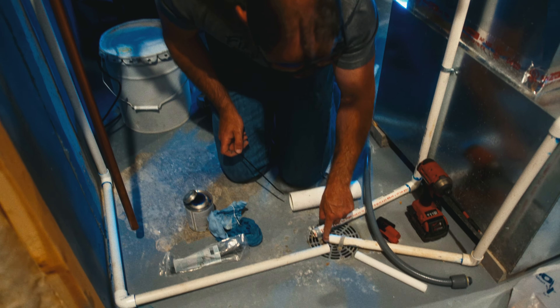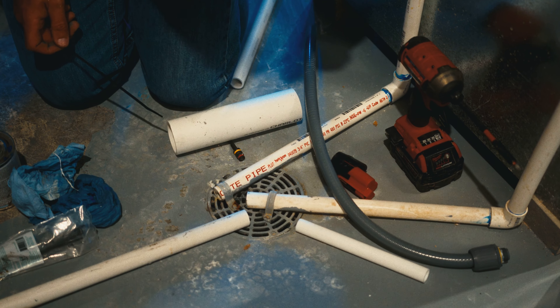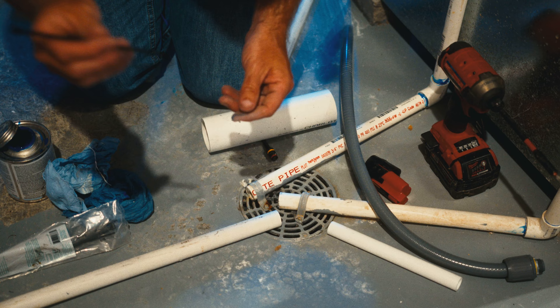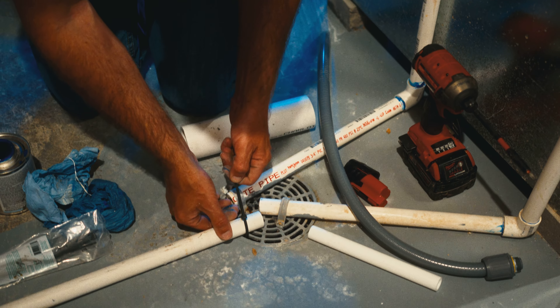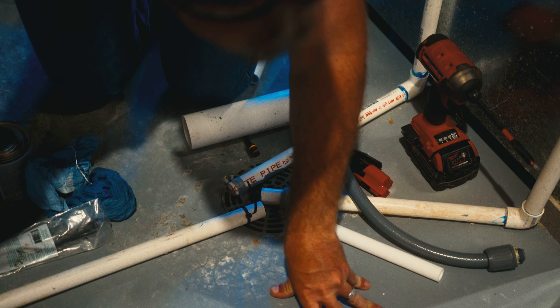The older contractor used screws and screwed down brackets on the drain line, but those screws will rust over time — they're already really rusty. What I do instead is take a zip tie and run it down through and back up. I use a zip tie because a zip tie will never rust and it'll never rot — it'll always just be there.